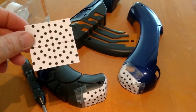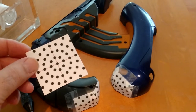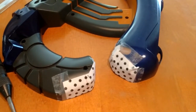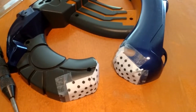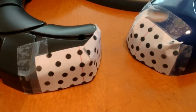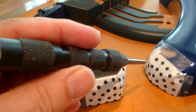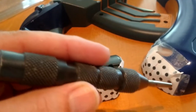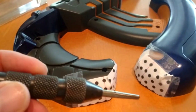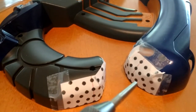We want to keep the holes looking as professional as everything else we've aimed for on this project. I went online, found a pattern of dots much like the microphone pattern of old telephones, and printed out this series of even dots. When we put the holes into the back of the plasma pistol, they'll be professional looking and consistent — rather than looking like some kid just took to it with a drill gun. I've taped the patterns onto one half of the shell and I'm using a center punch to put a divot into the plastic at each dot, which will keep the drill bit from wandering.